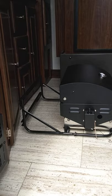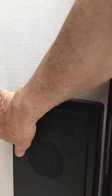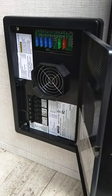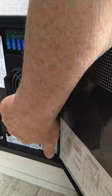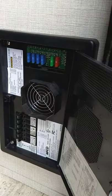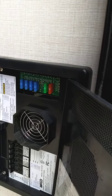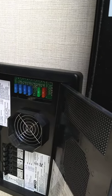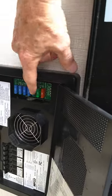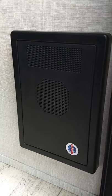This is your grill — it's just sitting on the floor here, but it hangs right on the swing-out bracket I showed you. This is your power converter — it converts 110 AC down to 12-volt DC. Some things have to run on AC power in a trailer, like the air conditioner and the microwave. You've got regular household-type circuit breakers there, and they're labeled. The rest of the power is converted into 12-volt DC. You've got automotive-type fuses for the DC — everything that runs on DC: the lighting, the motors inside, the furnace motor, the slide-out, all those things. If they blow, they'll light up and you can see them through this perforated plastic. This is also a battery tender, so it'll keep your battery charged as long as you're plugged in to shore power.